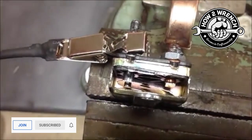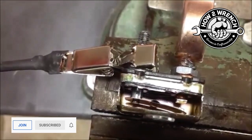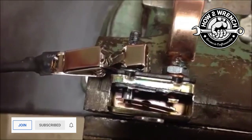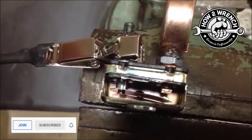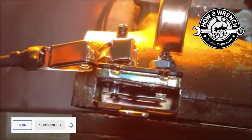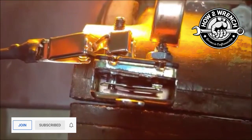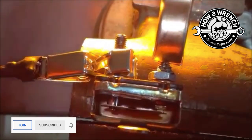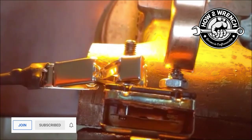As you can see, when we applied a direct short, the circuit breaker popped open, disconnecting the load — or the light, if you will. Now it needs to cool down to reset itself. Unless you remove the overload, it'll keep breaking. See how it automatically turns back on? Well, there you have it. Now you've seen inside an automatic resetting circuit breaker and actually have a better understanding of how they function.